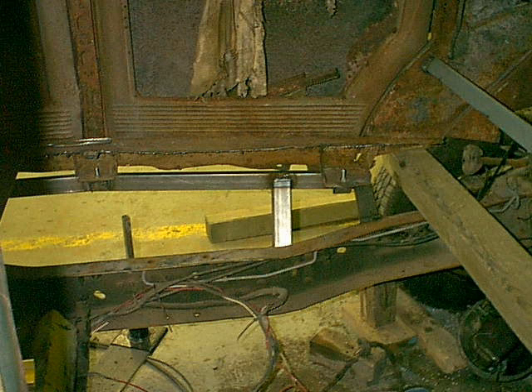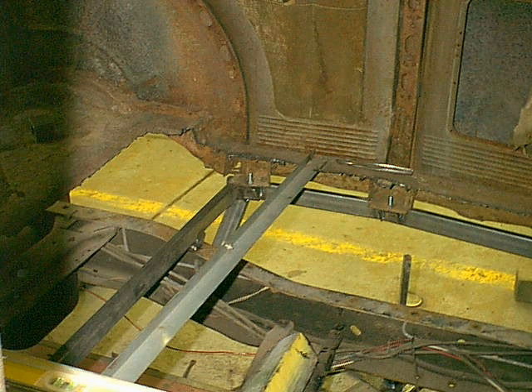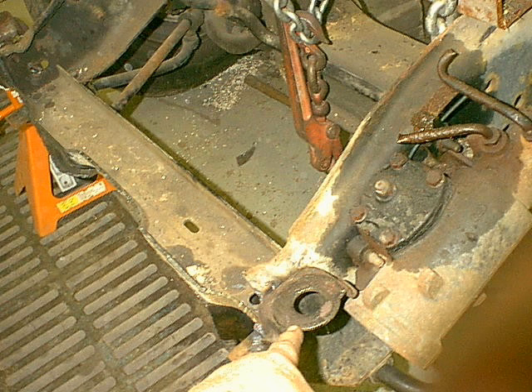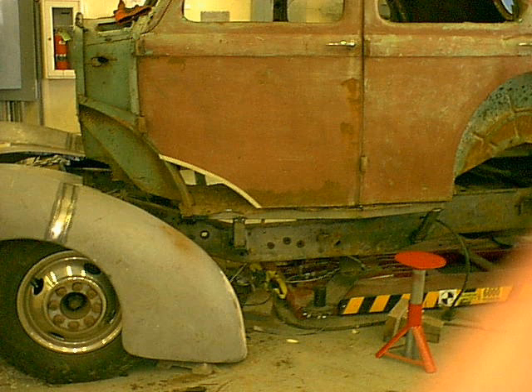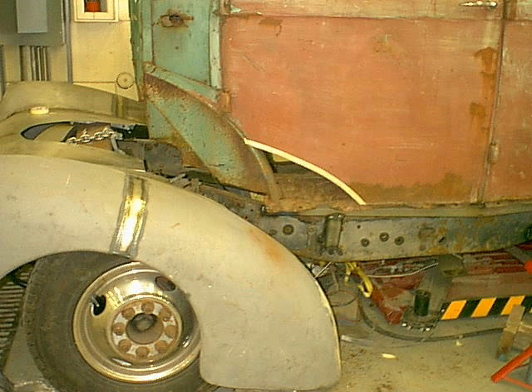You can see I've got some braces coming down to the stock frame and got that welded up good. Up on the front end I've added a couple of — you can see I'm pointing at one — coming out the front end. Now we're sliding the fender up and getting the door marked because we're going to have a new opening on that door for the new fender location.